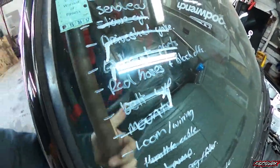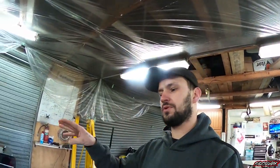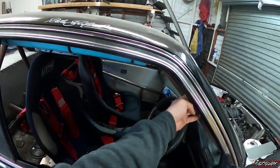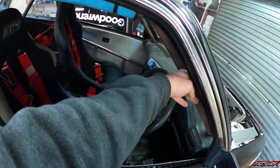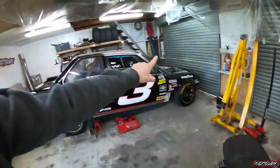I'm going to make some dimple die gussets through here, literally just for looks. I was going super weight-saving at first, but figured we've got enough power to push through an extra few grams of steel on either side. So we're going to chip away and make up those gussets, then I might jack the front up and have a look at a few bits, do a bolt check after the track day. We've definitely got plenty of little jobs we can get stuck into.